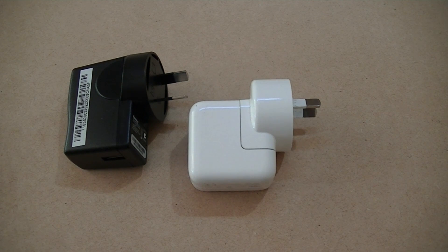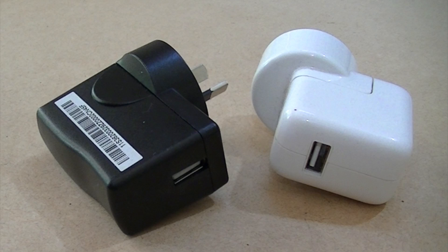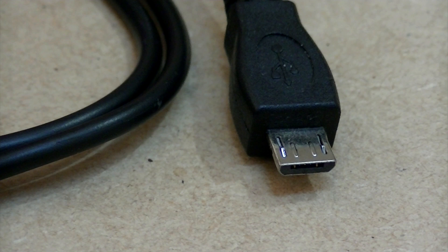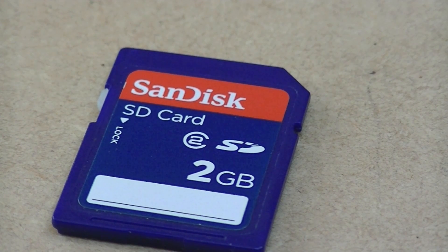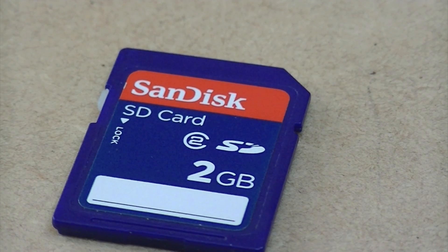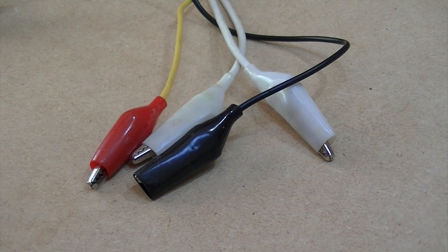The Raspberry Pi Foundation recommend a USB charger that outputs 750mA or higher at 5V. Here I have a micro USB cable — this will provide power to the Pi. Your operating system of choice will be stored on your SD card, so make sure you select a suitable card for your operating system of choice, as they can vary greatly in size. The next item that I recommend is some jumper wires — these will easily allow you to connect your projects up to your Raspberry Pi.